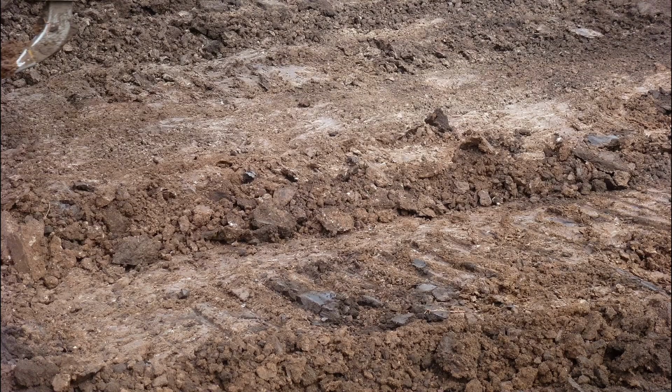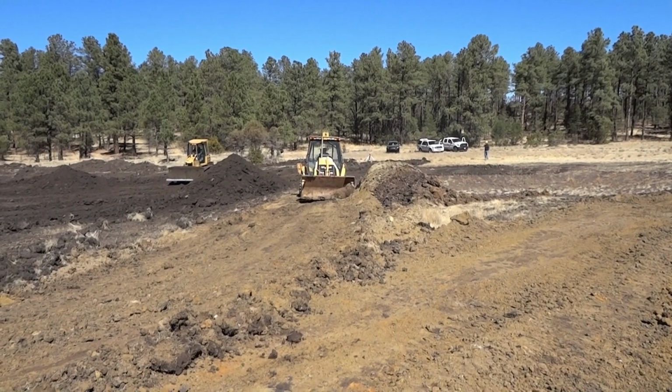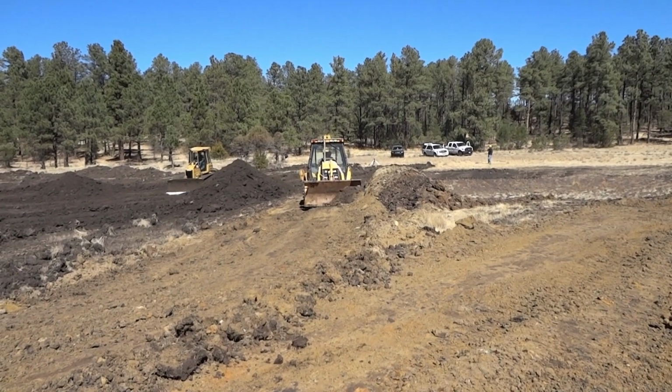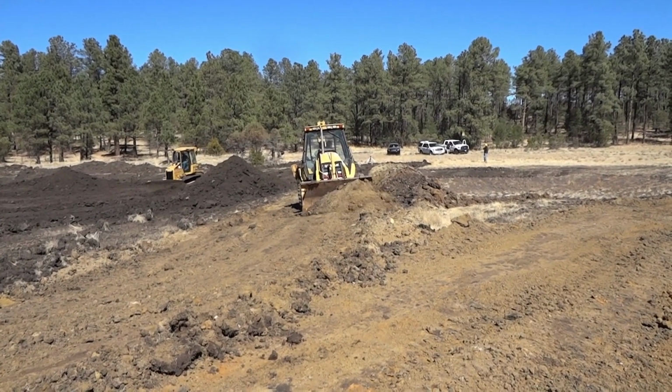Here we're removing the sand so we can make the wetland deeper. The sand will then be covered with compacted clay that is 24 inches deep. The backhoe operator picks up the sand and moves it away from the wetland being built. The sand can be placed in higher ground in sunlit areas to create turtle nesting mounds.